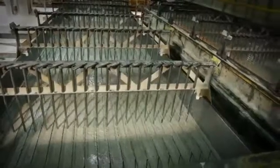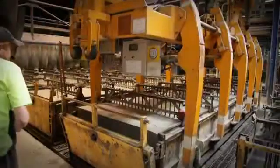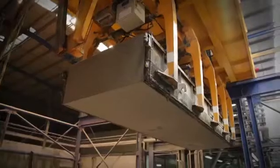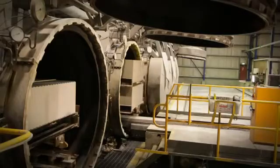This combination creates a chemical reaction that forms tiny hydrogen bubbles and more than doubles the volume of the slurry. The slurry then cures to a cake consistency before being cut to required dimensions. The batch is then cured in an autoclave under pressure at a high temperature.